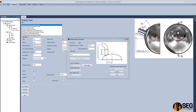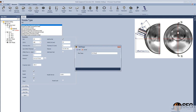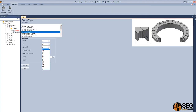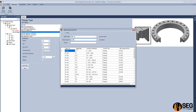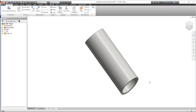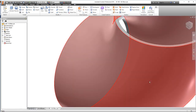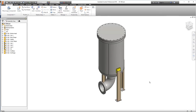Define the projection of the elbow and click Save. The value of the pipe projection will appear. Now let's add a flange after the elbow. Select the suitable type which is weld neck raised face per ASME B16.5. Define the rating, size, schedule, and material. Now let's assemble — the pipe, the reinforced pad of the nozzle, the 90-degree short radius elbow, and the flange. Now we have the assembly.